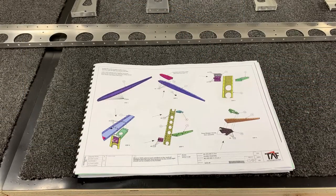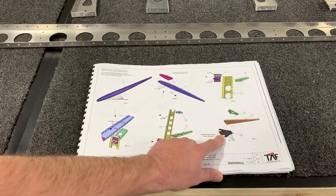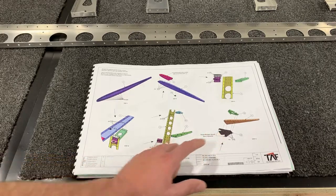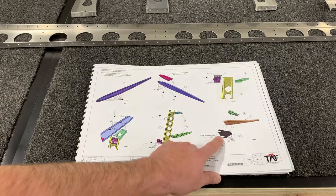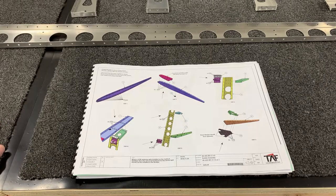Looking at the first assembly page of the rudder, we'll see the rivet detail for the rib structure. As always, it's important to make note of the rivet direction. On this page, we're going to hold off on installing the counterweight as well as the bottom plate for the rudder cables as long as possible. The reason is similar for both: the counterweight will cause the entire assembly to flex unnecessarily as you're adjusting and repositioning, and the outside flanges of the bottom plate will not allow your rudder to rest flat on the table.